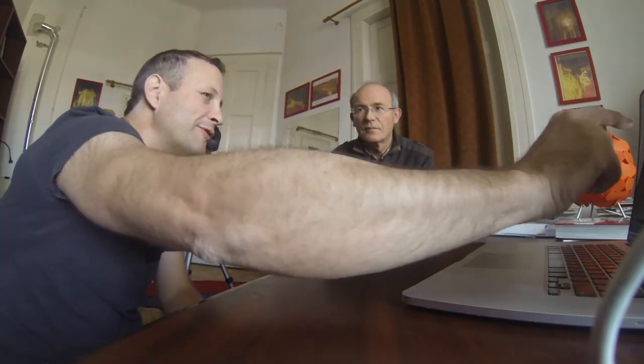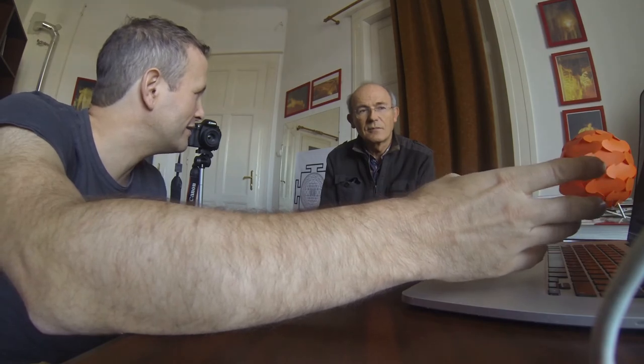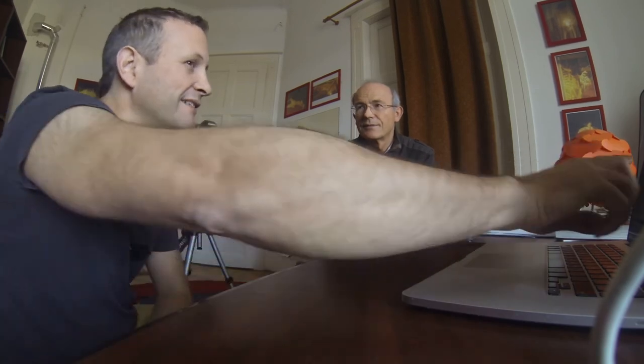So how big should it be? 15 millimeter is the lower limit at these power supplies, and 25 is the maximum, so the diameter must be in between. So perhaps if they could find some sort of quartz lamp bulb that was in that range. But you're right, they tend to be crimped, don't they? And the crimps are very small. So how would they get the quartz to the temperature? I mean, electrically heating to 1500 degrees to make it soft maybe is not... No, I mean, you switch on the power supply. No, I mean to make the resonator, for the manufacturing. You have to go to the glass blower who is able to deal with quartz, and that's the bottleneck, actually. And if you don't have anybody, then you are doomed.